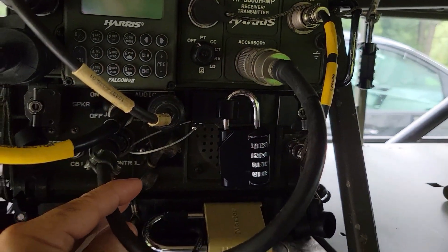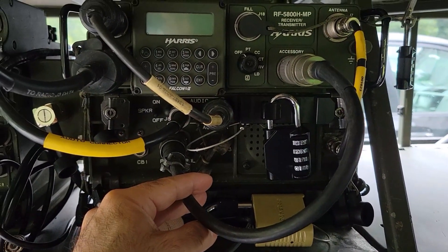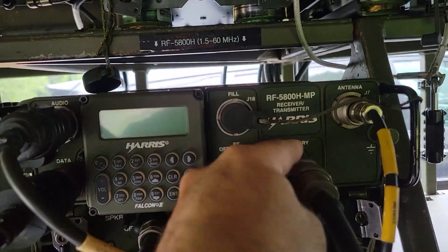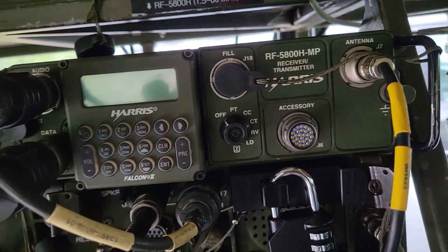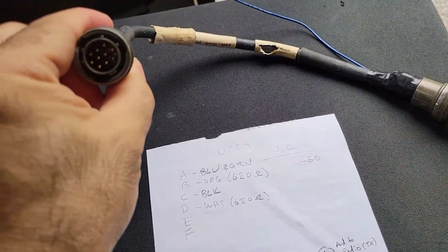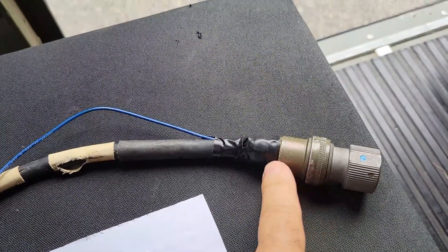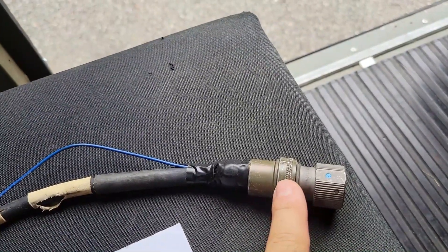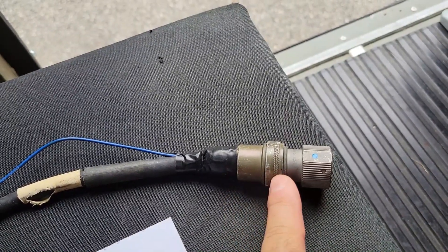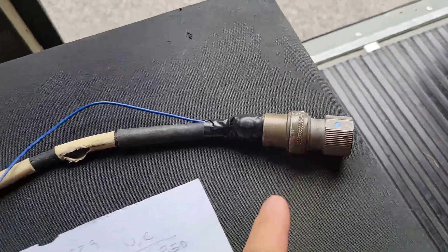This cable goes to the base here and controls the power amplifier, the audio amplifier, and ultimately the coupler - it's all controlled through this cable. The question is how can I pull out that signal? What I did is I found an old junky cable that happens to be the same as the original. I opened it up, and believe me, this was really trying - tiny connections, really tight in there. Couldn't push the back shell back very far. Had to slip in the soldering job when done, remove solder bridges, and slip on some heat shrink. It was quite the job.